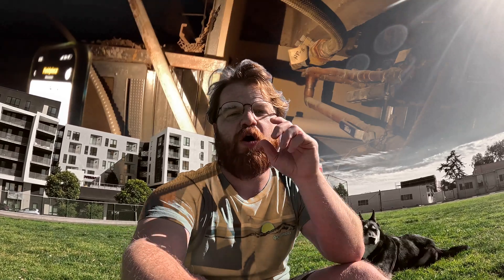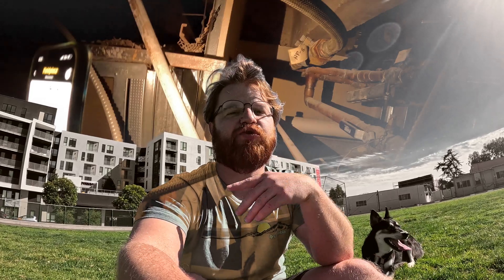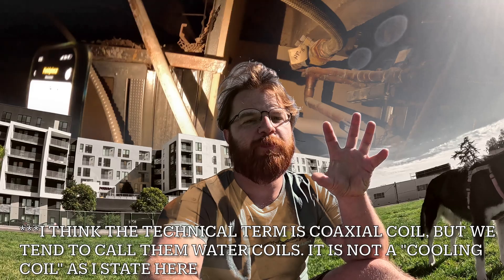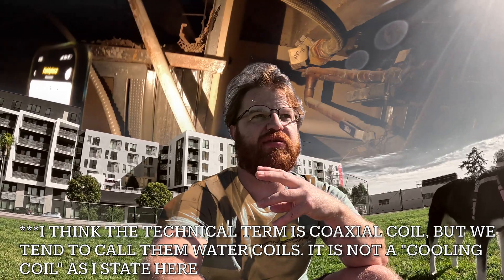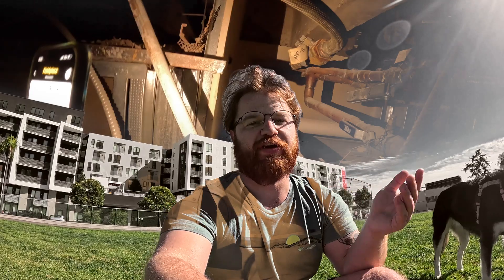The solution is they have one central outdoor unit for the whole building. That outdoor unit pumps water through the building using water lines to remove heat — if running in cooling it removes heat from the building, if in heat mode it removes the cool. The water going through those lines isn't always super clean, so you've got this cooling coil with refrigerant lines and water lines, and that's how the heat or cold is pulled out of the unit. If the water flowing through is dirty, it will eventually clog up that coil.